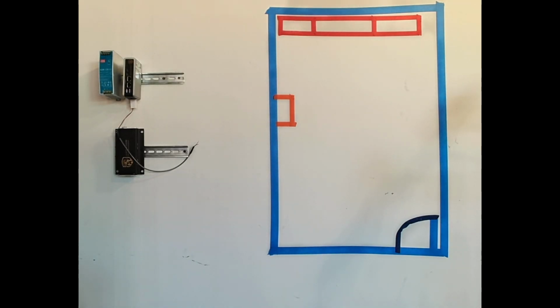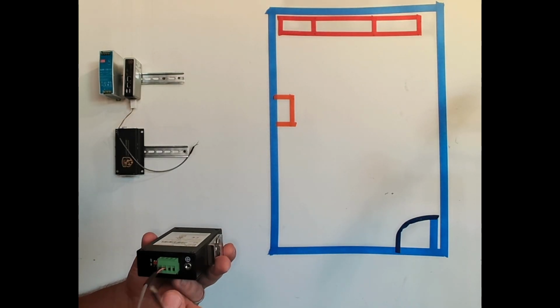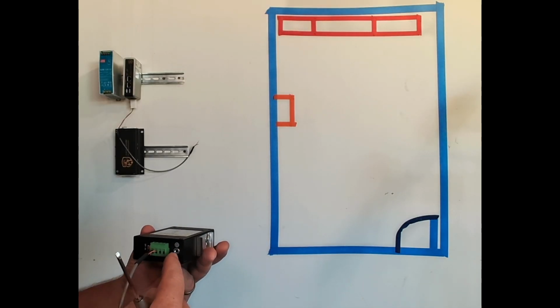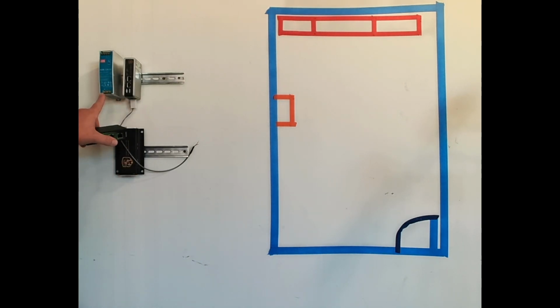There is something, because I'm just doing this on a drywall board and it is a demo kit that travels, there is something that I'm missing that you guys should not. And there's a ground screw that goes right here. You should have a shielded wire or a 3 conductor to come over here and pick up the ground. And it should all be grounded back to basically your earth ground to your power supply. I'm not going to be doing that, but it's something that you absolutely should. I'm not going to be doing it because, again, this system is set up to be traveling, and we're never connected to necessarily a true earth ground. So it's not set up to do so.